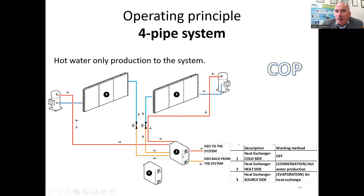When we have a heating demand and no cooling demand, the refrigerant is diverted. This is a very simple schematic — there are four-way valves, intelligent controls, suction accumulators, and other components, but this is simplified. The compressors pump high-pressure, high-temperature gas through the recuperator, thereby heating the water. The refrigerant then goes down through the expansion valve — what was a condenser is now an evaporator — giving you low-pressure, low-temperature gas back to the compressor.